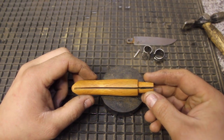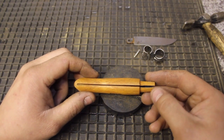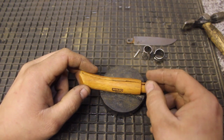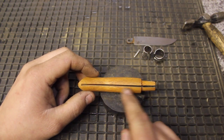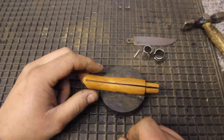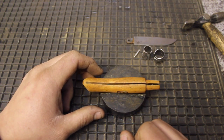The main trouble I personally have with Opinels is that when they get slightly damp, because they have a wooden handle, actually opening the blade can be quite difficult sometimes. What I've seen a few people do is actually just gently remove some material inside the handle with some wet and dry paper. It gives you slightly more clearance and just allows the blade to move slightly freer. We'll cut the wet and dry and make a start on that.